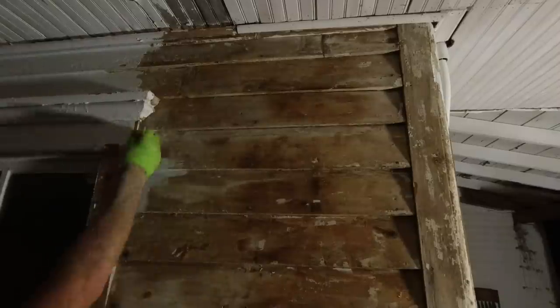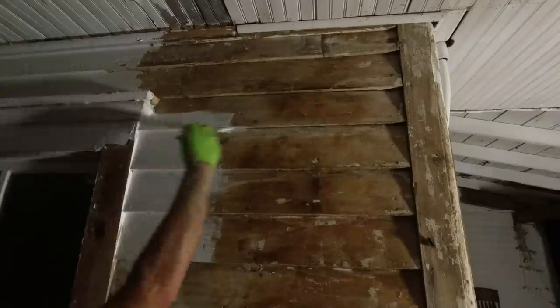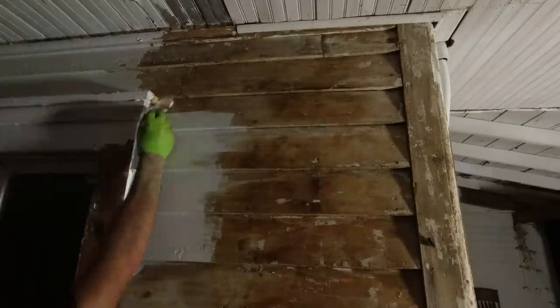Now we're back in time, a few months ago. What you're seeing here is we had a lot of water damage on this section of the house. The rain was coming through the clapboard and rolling down the wall, so the paint was not sticking at all. I scraped it all as deeply as I possibly could, sanded it, and now I'm applying a Zinsser oil-based primer coat.